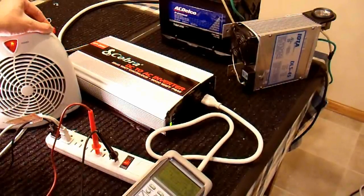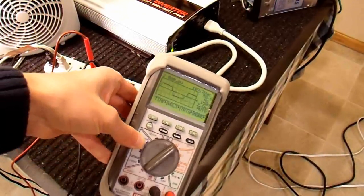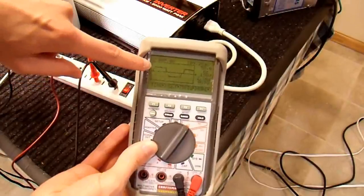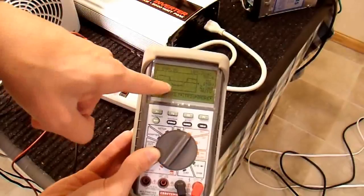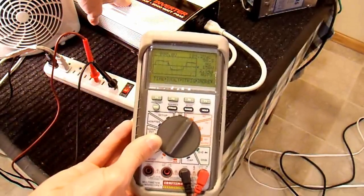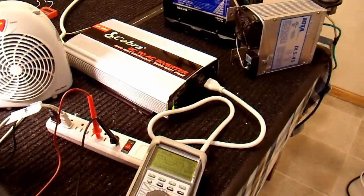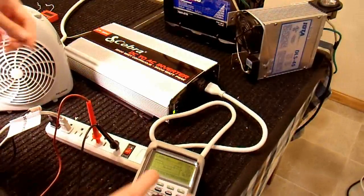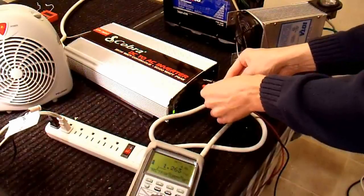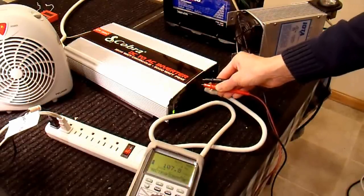Trying high — that's 1500 watts. My output voltage just dropped; you can read the multimeter, it's at 109 volts. The waveform goes up to 145 volts and then sags, starts at negative 145 and then sags again. That's indicative of not having enough output capacitance — the output capacitors are clearly not adequate; this line should stay flat. Measuring directly at the output: 108 volts, still not adequate.